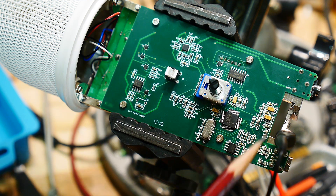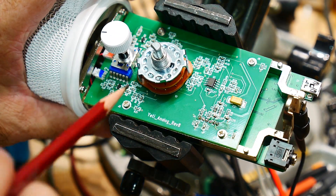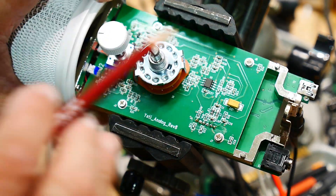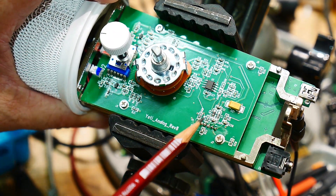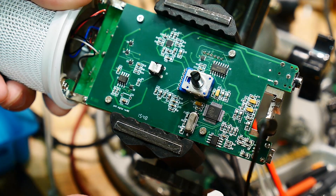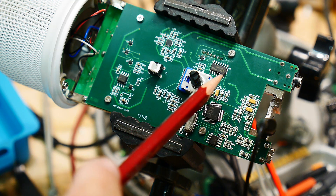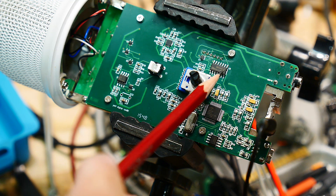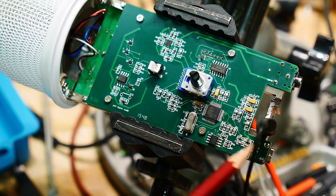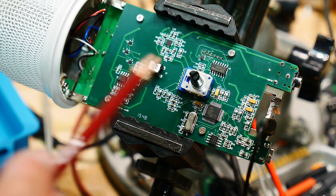There's a digital board and on the back there's an analog board. Last night I troubleshot the circuit and the analog board is working just fine. There's a connector that goes between the boards - this is all just analog circuitry and there is an audio signal getting passed to the digital board. This board has a couple chips on it: a 4066 analog multiplexer chip, what I believe is a USB chip, and a couple of little chips I'm not sure about.